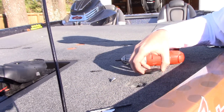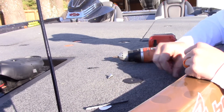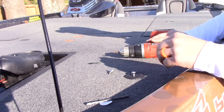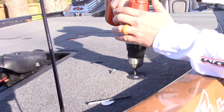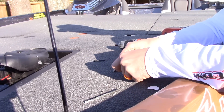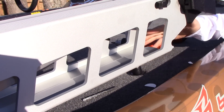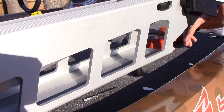If your boat came with one of the little plastic pieces, you'll have an outline for it where you can place your Deck Saver right there. If you don't, simply lower the trolling motor down, get an idea of placement, mark it a little bit, drill your pilot hole, grab your cordless drill, use the larger screw for the bass boat, run that down, roll on your sticker — and now you're gonna be protected. You're not gonna have any issues with wearing holes in your carpet. Made in the US — check it out guys, it's the Bob's Machine Shop Deck Saver.